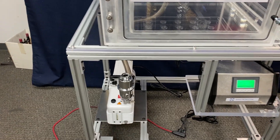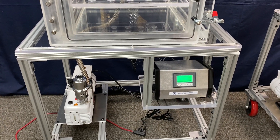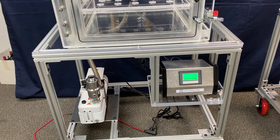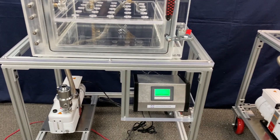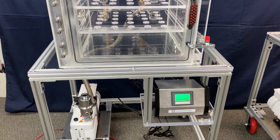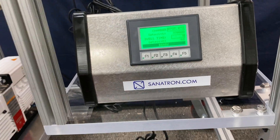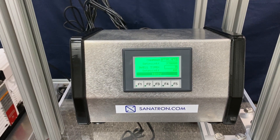We also have a rotary vane vacuum pump. For this system it can go quite low — probably about 10 or 20 millitorr if you keep pumping it down for a while. But for practicality, we're talking about 100 to 75 millitorr, which you can reach within a fairly reasonable time. That's about 250,000 feet at 100 millitorr — I'm speaking off the top of my head. There is a table on our website, and I'll provide a link below, where you can look at the altitude versus absolute pressure table.